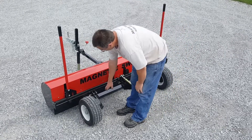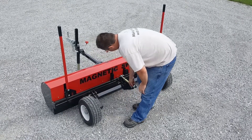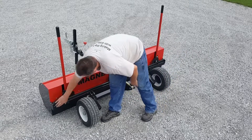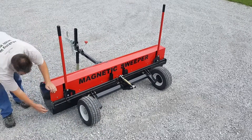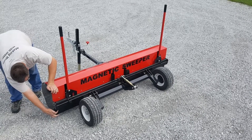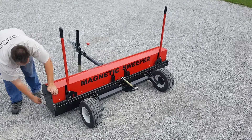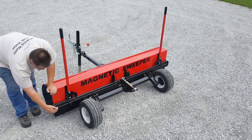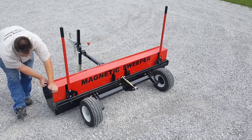Everything in this sweeper is heavy-duty. All of the tube is 3/16 inch thick steel, and all of the plates are at minimum ¼ inch thick — some are 5/16. These parts here are ¼ inch thick steel. The rear tube is stainless steel, 3/16 inch thick. The entire bottom pan is stainless steel, wrapping all the way around to the front, and it's ¼ inch thick stainless on the bottom. We do that so that when you go to release the debris, all of it will fall off — everything in a magnetic field that's steel becomes magnetic, so we tried to eliminate as much steel as possible in the area of the magnetic field. The end plates are 3/8 inch thick steel and connect the rear tube to the front tube.